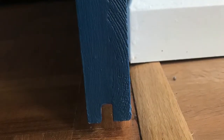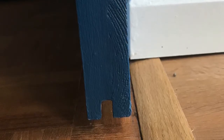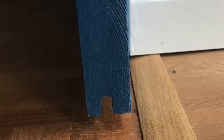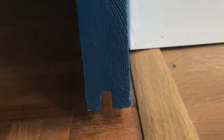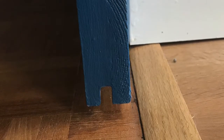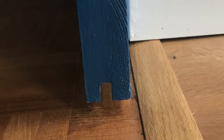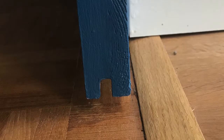As I hadn't taken a photo of this process, I've just demonstrated it here. As you can see, I managed to make a groove by essentially putting a narrow piece of timber that fixes onto the base of the door and still gives enough clearance to the skirting board. That allows a channel to be formed, which is important for when you fix your guide rail to the flooring — it allows the door to run in a straight line.